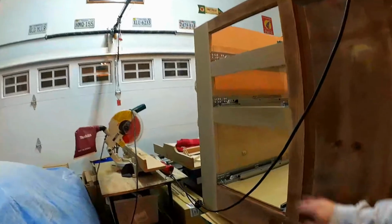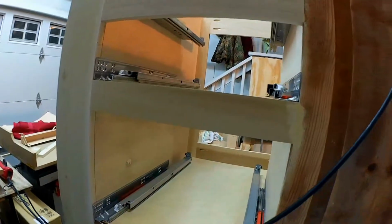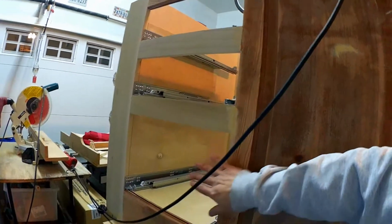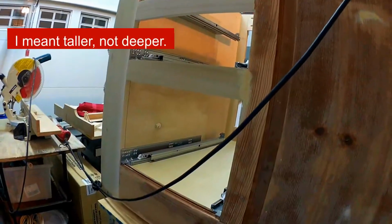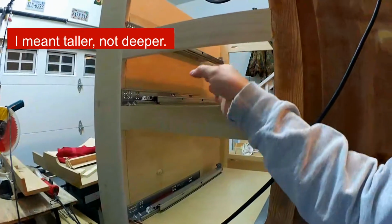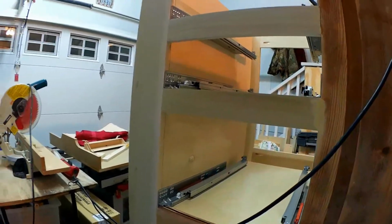You can see that on this back side, because it's where the dishwasher will be on that far side, it'll be closed off, so you won't actually see anything. Originally I had 4 drawers here, but I've changed it to 3, because I wanted a deeper one for napkins and other items for the kitchen table. It allows a little more flexibility. I made these a little deeper than the originals. I think they were originally 4 inches and now they're 5 inches deep, for tablecloths and mats and things like that.